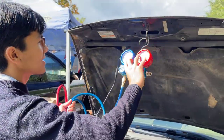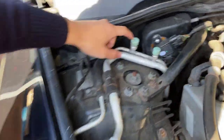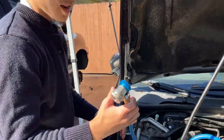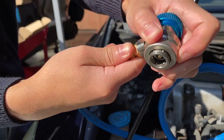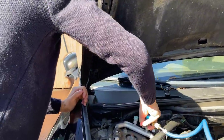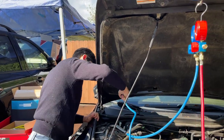So this is how it works. We're going to hang this right here, then take our hoses and locate the high pressure and low pressure caps on our car. We're going to take our low pressure valve and twist off the cap for low pressure. You'll notice that the low pressure valve has a quick release valve that allows you to quickly pull it up, push it down and release. You can pull it to check if it's on there securely. The reason it's called quick release is because before you'd have to screw it in, but now you just push it and it lets go easily.